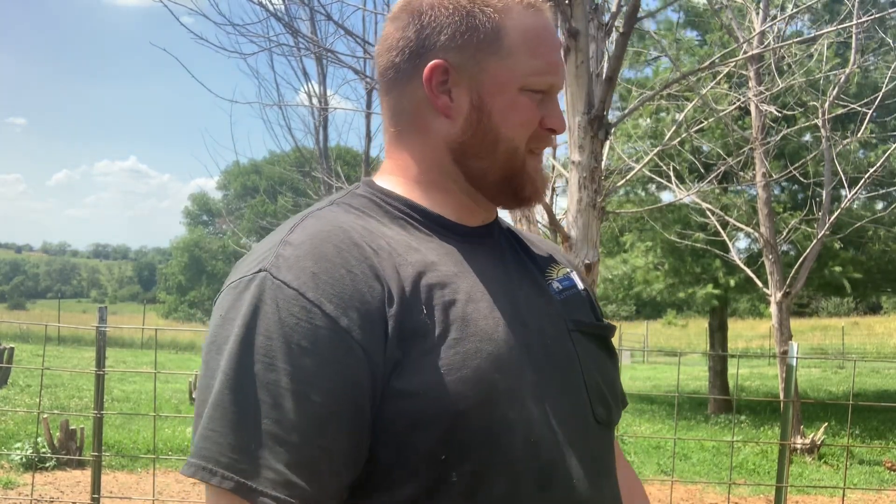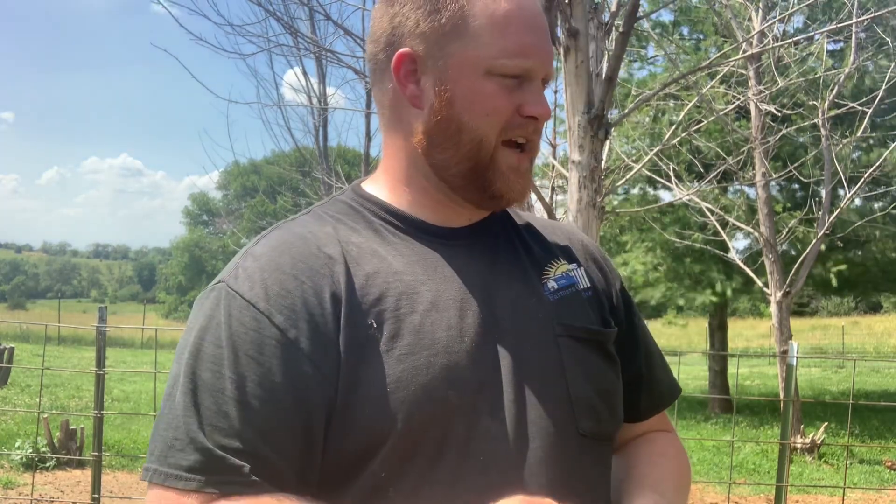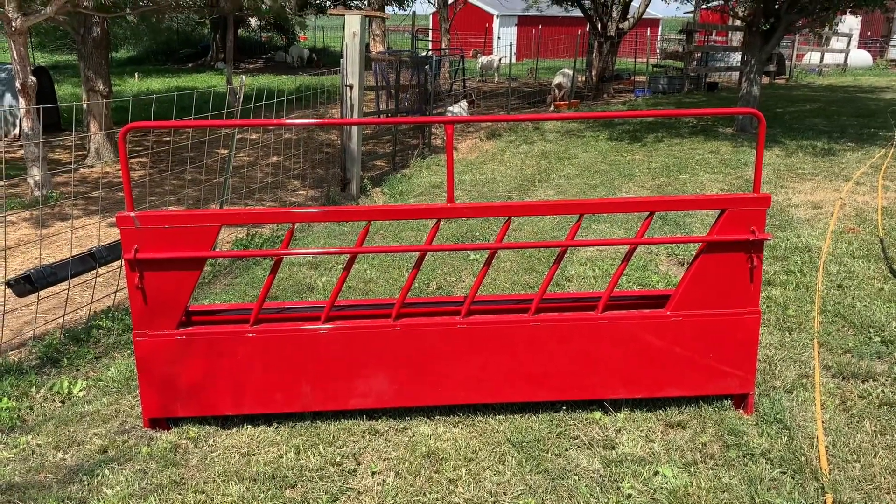Me and Shana can't pick it up, so I know it's going to last us quite a while. It's got a couple of drain holes built in. When I was designing the pan, I wanted the option — if we had a hay grinder in the area, or a neighbor with a processor that could come over and grind up a bale of hay or alfalfa — to be able to feed that. Just enough pan space to dump in some ground alfalfa, but still have their hay feeders with prairie hay or grass. Let me get you turned around and show you the first iteration of what I'm going to call my Lucky M prototype bunk feeder.